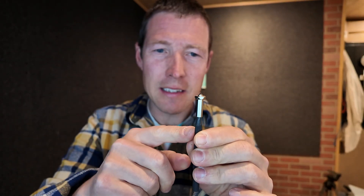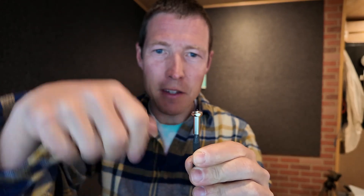So if you remember, I was drilling out my nozzles for my Anycubic Cobra 3 from 0.4 to 0.6 and also 0.8. But what if you want to go the other way? I had broken off a drill bit in this 0.4 millimeter nozzle, so I'm going to go in and press out that hardened steel 0.4 millimeter insert with a punch. I'm going to clamp this into my vice, put the tip on it, put a socket or something over the top, hammer it down, and hopefully drive that carbon steel chunk out of there.